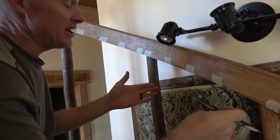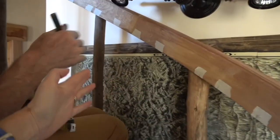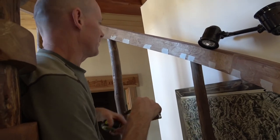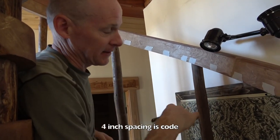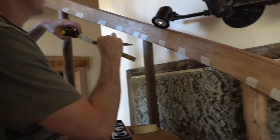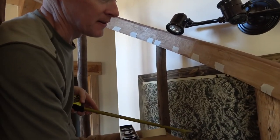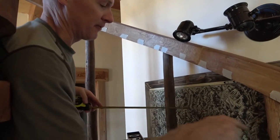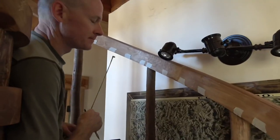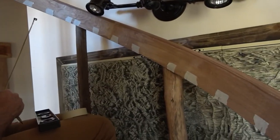This is the spindle. They're not all perfectly exactly the same. Yeah, the spacing between the wooden spindles is not the same. So I'm individually making sure they're 4 inches at least, at the most. But there's a little bit of, it's like 4 1/8 or something like that. Typically, once it gets to the bottom, it's narrower. So it's really only this part. As soon as you get down a little bit further, some of them kind of bend out this way. Plus, you have the width of the spindle, which is going to shrink the width between the opening. It's not just the on-center measurement.